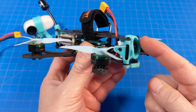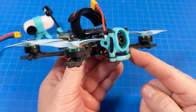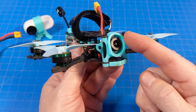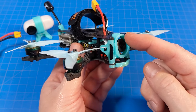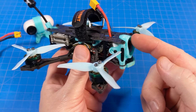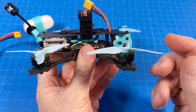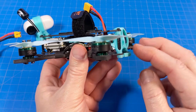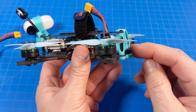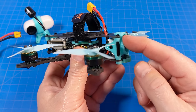One thing I mentioned earlier: you can't get a lot of camera angle without the TPU camera protection showing in your FPV view. This is about the maximum angle I found. I had it further up and could see a teal or aqua colored TPU print, so I moved the camera down slightly. If you want extra camera angle, you could use a soldering iron to remove that TPU print and clear your view. There are two angle positions available.